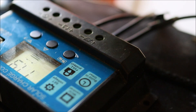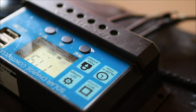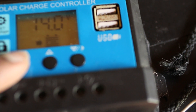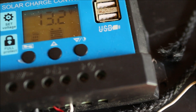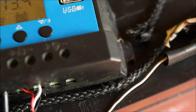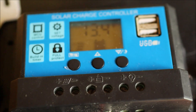We have the negative and positive in place. I'm going to take the panels outside — and there you go, you can see the panel signal show up. The voltage you're looking at here is not what is in the battery; this is just the float coming from the panel. This is the maximum voltage the solar charge controller will allow. This is the disconnect/reconnect threshold — if the voltage drops below 12.5V, the load will disconnect to protect the battery.